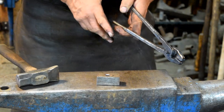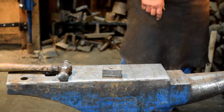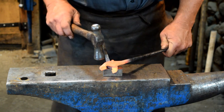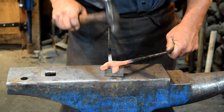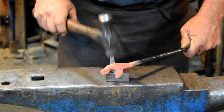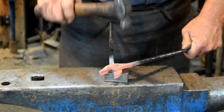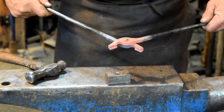I'll put these in the forge — put this side down in the forge if you have a coal fire. We've got our rivet hot. I'm going to push down on this top blank with my left hand to hold it tight and I'll use my ball peen hammer to rivet the top side.